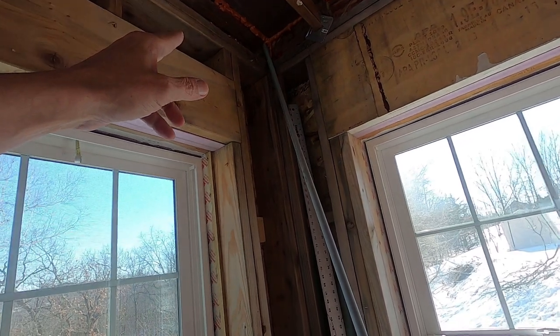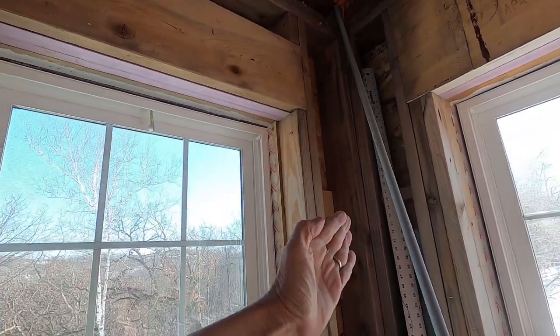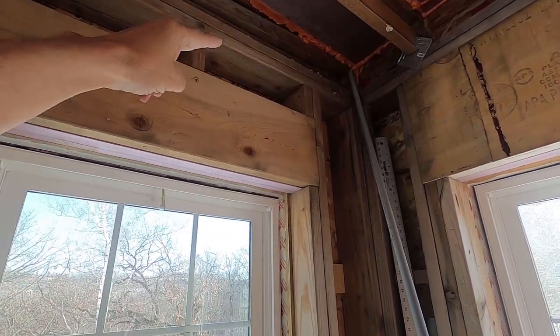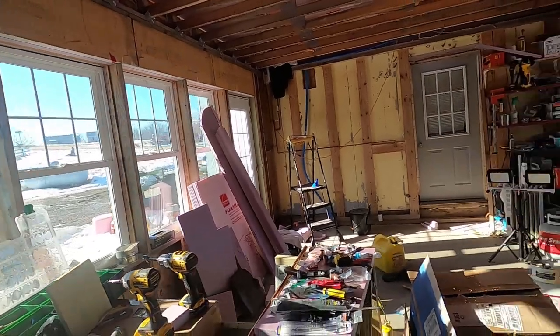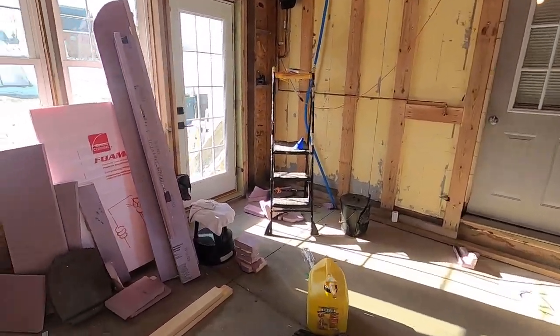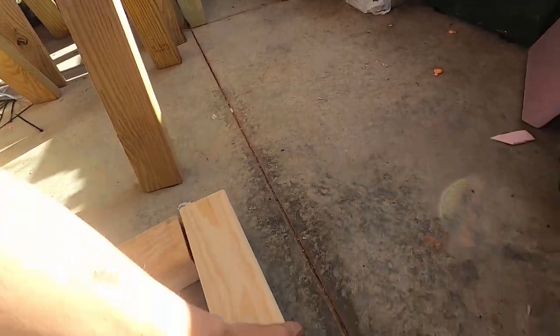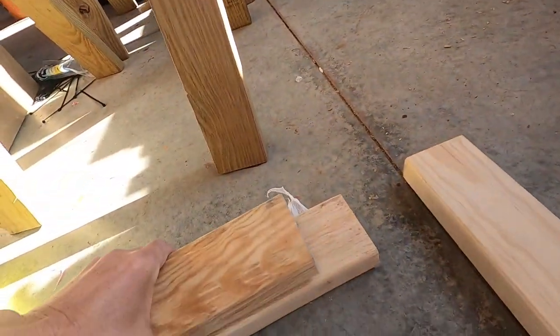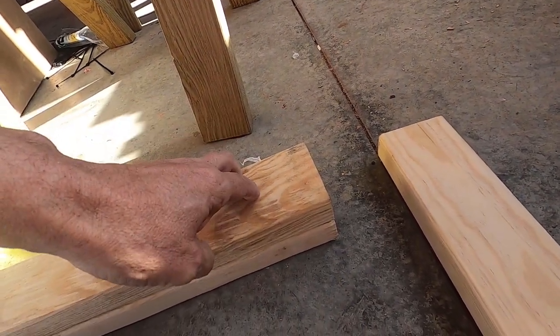We'll start with that detail. It's where the walls come together here. You have a top plate, which is what the studs are connected to, and then a tie plate that is on top of that. That's why they're double like that. And this is what I saw on Jason's last video.